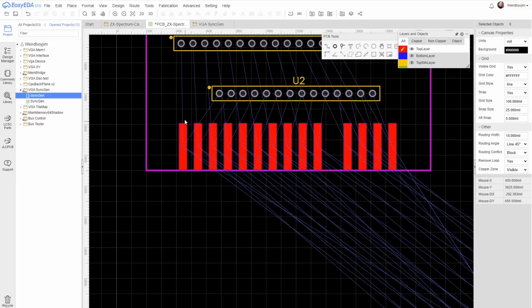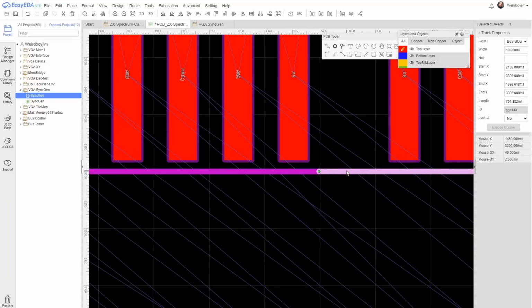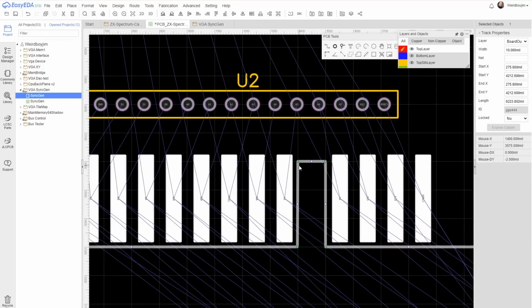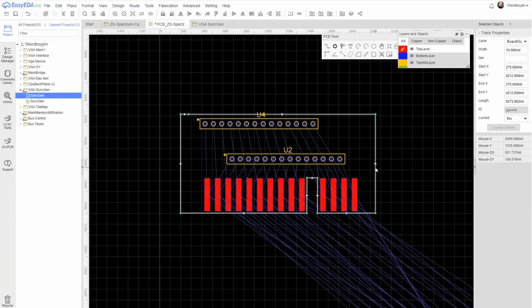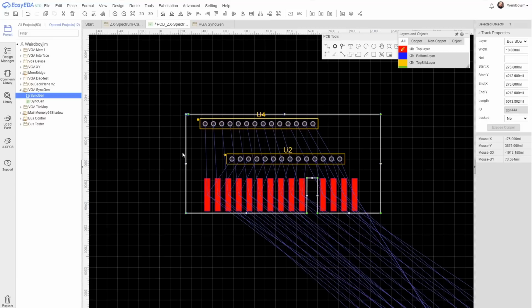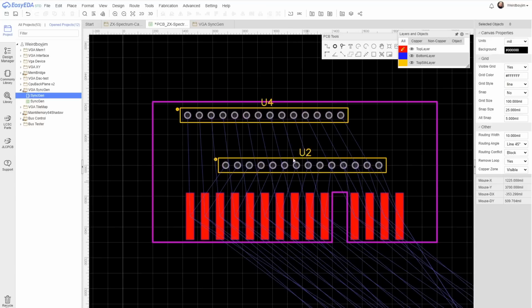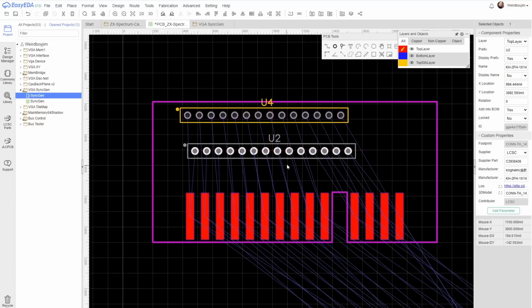Now, that doesn't look like these pads are very well centered on the grid spacing. Now, inside the Interface 2, it is an open-ended connector at each end. There's not a lot of documentation that says how far we're supposed to go each side. Okay, I don't think this header's 2.54mm.